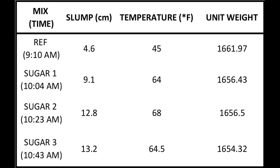First let's look at our fresh properties: slump, unit weight, and temperature. When we started putting sugar in we got a more flowable concrete — going from 4.6 all the way up to 9.1, 12.8, and then just killed it at 13.2. We often see that with retarders, and sugar can be considered a retarder. The immediate temperature didn't change significantly — it went from 64 to about 64.5 degrees. We did see a change in unit weight, which could have been from water retention, mechanical air, chemical air, or the stickiness of the sugar with the salts in the cement pore solution — it dropped noticeably, though not dramatically.